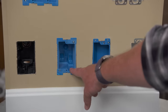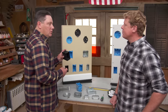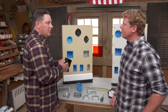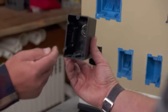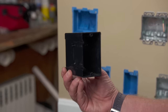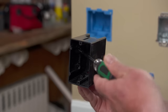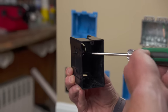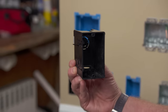What's the difference between this one and this one here? This one you can use on new drywall as well, but it also helps if you have an older home with plaster and lath. If you can find the stud and cover it up against it, you can actually slide this in and screw it from the face. It's got a screw at an angle coming out that side. The idea is that you can access it from the front and drive that into the stud, securing the box right to the stud — acting like new work, but it's actually old work.